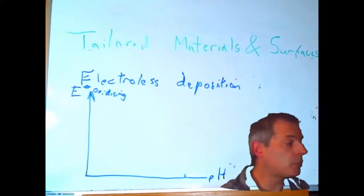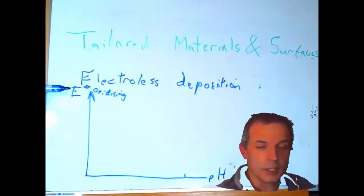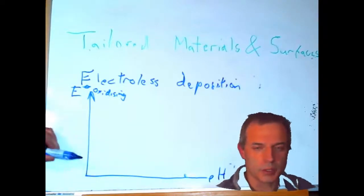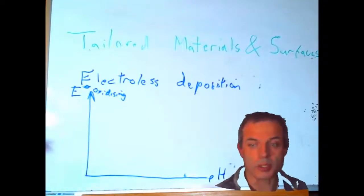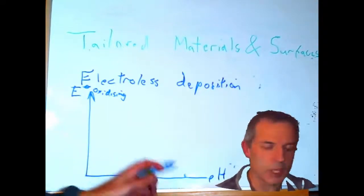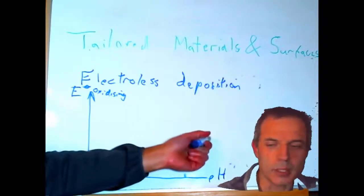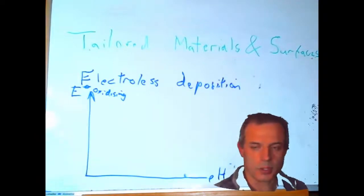So what my students should remember is that we used to have a Pourbaix diagram in our last course, where we had the E0, the electrode potential, and the pH, to give us a diagram of how oxidizing the conditions need to be to dissolve a metal or to make different species out of it. Remembering that it's a thermodynamic diagram, so we're assuming things take forever, we would have the metal down at the bottom, metal oxides and other species, typically the metal ion here and a metal hydroxide anion over this end. So that was a previous version.